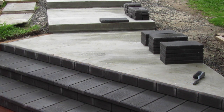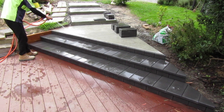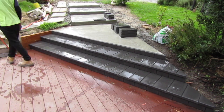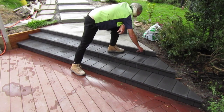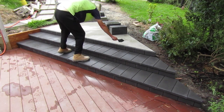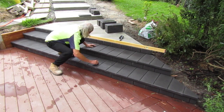I always give the area I'm working on a thorough wash down. It helps the mortar stick to the concrete foundation and also makes it easier to wash off any spills we get on the finished pavers. I'm using a chisel to scrape loose any excess mortar from the course that we laid the previous day, then I sweep it clean and do one final check with my level and mark out any low areas to assist me when I lay the next course.